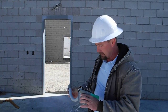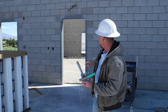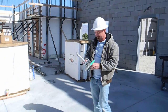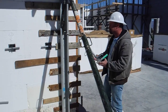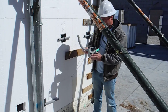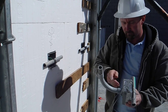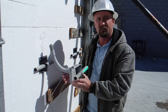We convert to rigid 90s when we come out below or when we go above slab into our electrical rooms. For ICF, I used the same concept, but instead of a masonry box — because the foam is so much thicker — I used the standard box. I took a PVC 90, cut it more, and glued into more of the radius to shorten it up and keep it within the wall.